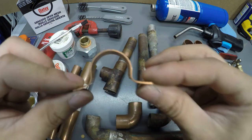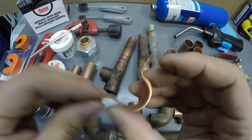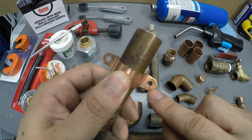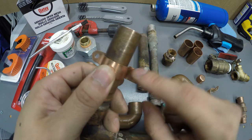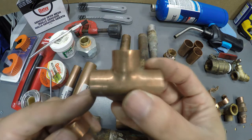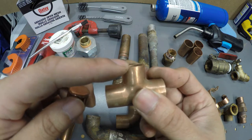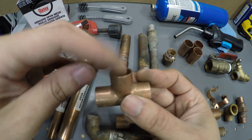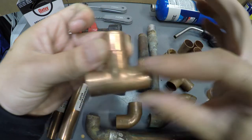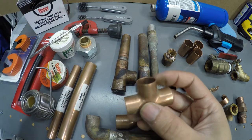These are copper straps — it's very important to use copper straps. They do make a little noise, so I recommend using plastic or rubber ones. If you use regular metal screws you'll start corroding the strap, so you need copper or brass nails. This right here is a cap. For example, if you install a T into one of your lines and want an opening for future projects, you can put a tube and solder this cap closed. Once closed it seals like a coupler, and when you desolder it you have a new pipe to branch off.